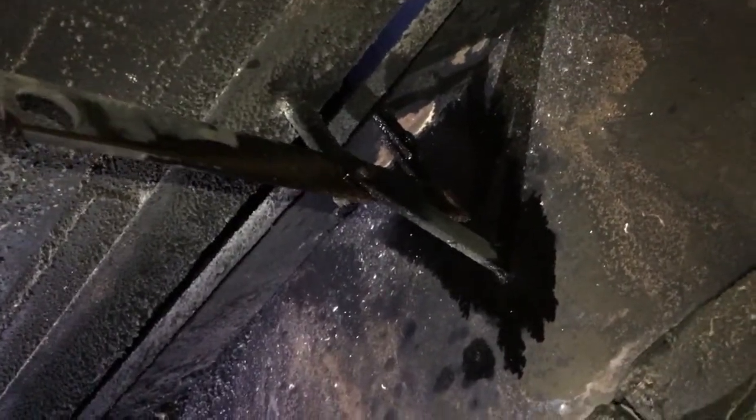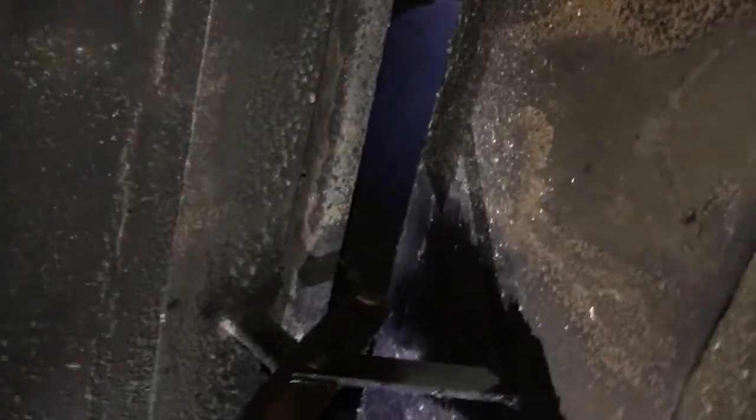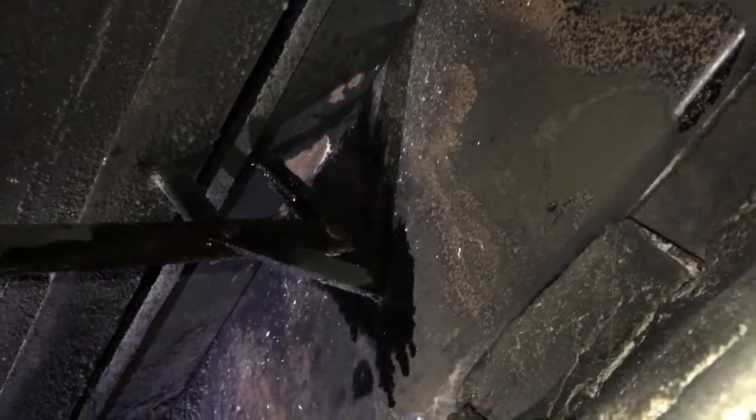Once I got all the soot taken care of, you can see all sorts of junk ended up everywhere — just creosote, water, and time. Over about six months it was a complete mess. Now when you pull the lever: the flue is open, the flue is closed. So let that be a lesson — after a period of time and some fires, these hinges on the levers do get gunked up and stuck. Just unstick them. Simple as that. Fixed.